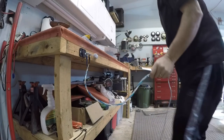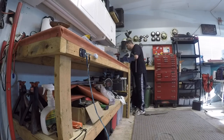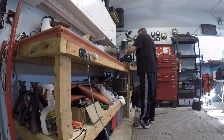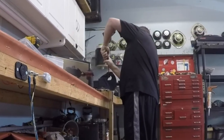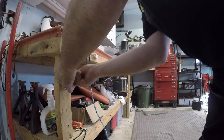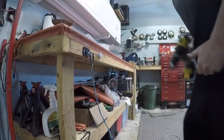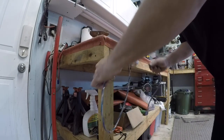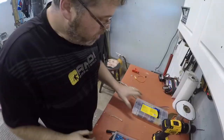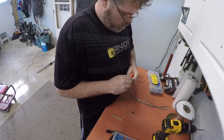I'll put a nail over here so I can hang this — a little hooky hook. I think I got a hooky, I do. I'll have to look for it. That's decent. No screwing around — we're getting her done today, boys. There's an eyelet, there's another eyelet. We're gonna have to make one. We'll just put her in a vise and give her a bending job. Put her in the old vise, then we'll take a pair of channel locks and open her up. There's her hook — made a hook! So we'll zing this into here. Run myself a little pilot hole — makes it a lot easier. Slop that in there. Now we can wrap this up.